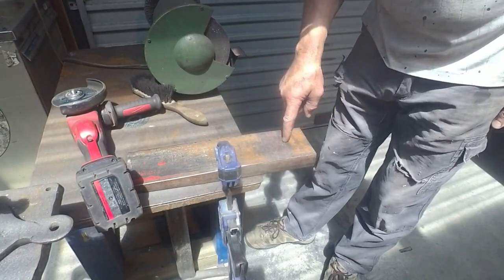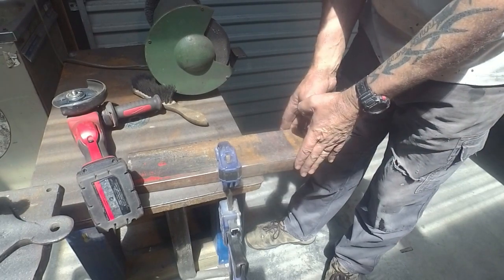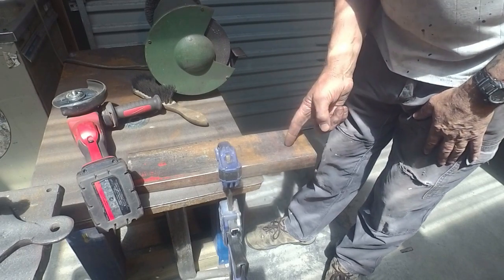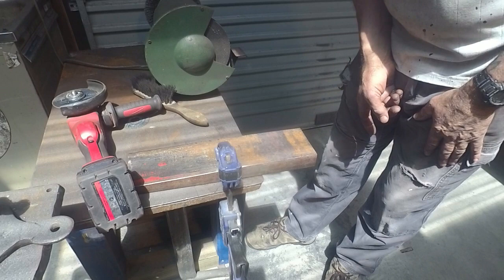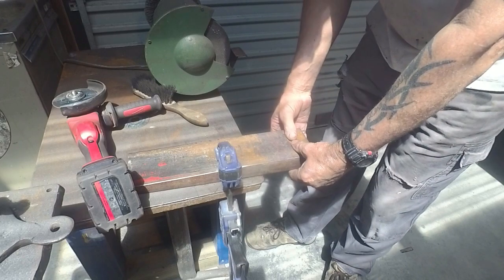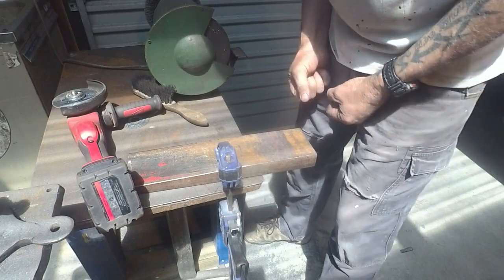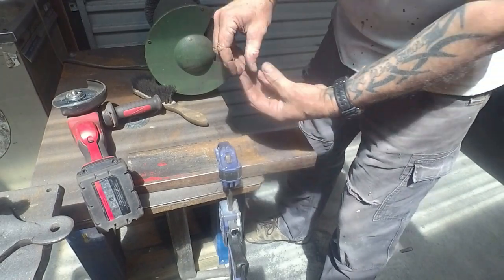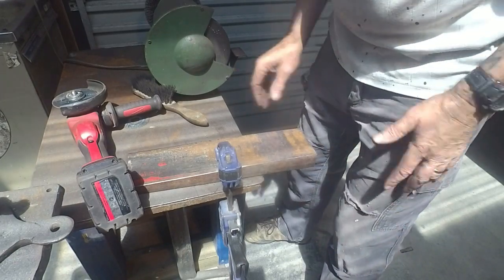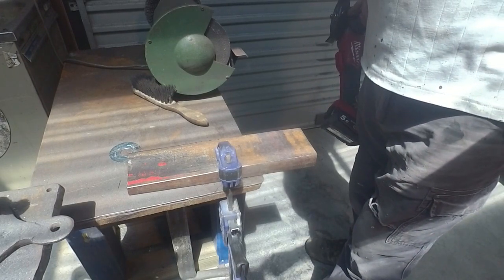I've measured 60mm — actually a bit under, 58mm from there to there. It's 100mm wide. So I'm going to cut it down the 60, halfway along, down the 50. That will give me two 60 by 50mm pieces to make my large fullering dies that will go on to the end of my 16mm main die. You don't need to see me grinding it, but that's what I'm going to do.